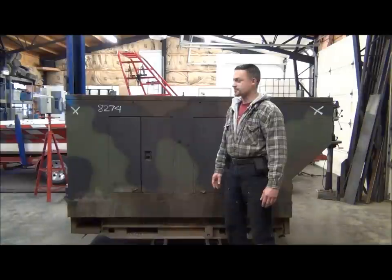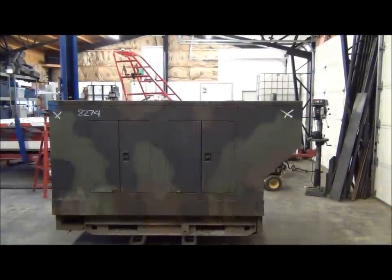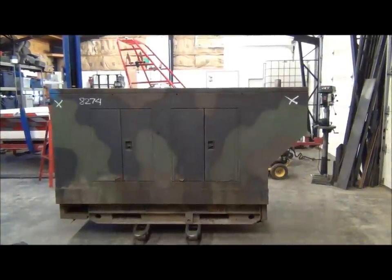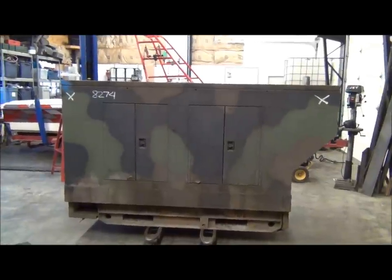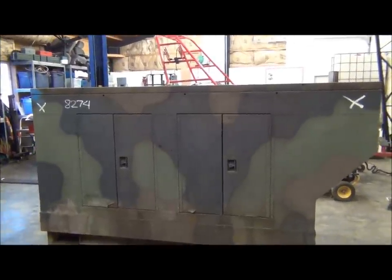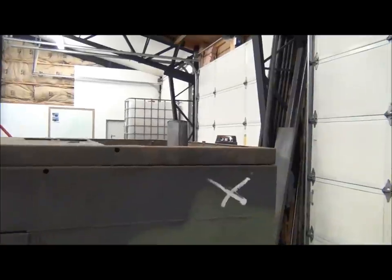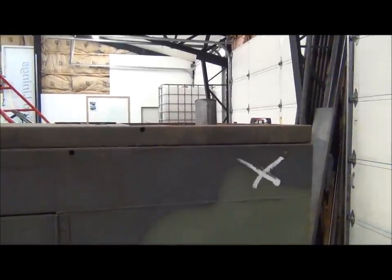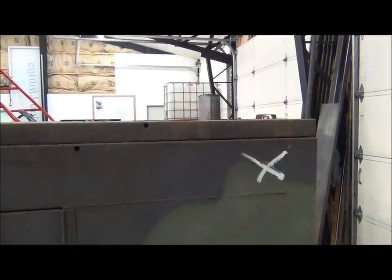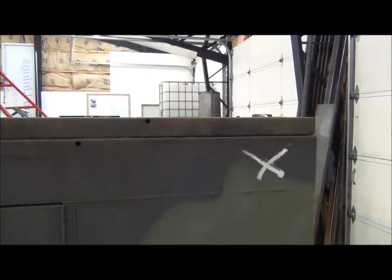It's definitely missing some parts and it's been sitting for quite some time. The first thing I notice is that it's got the acoustic enclosure on it and it's missing both the intake and the exhaust side dog houses. Those dog houses aren't necessary for operation but they do protect the generator from excessive water entering the housing. On the exhaust side in particular, the exhaust pipe faces straight up with no protection, so my big concern is whether the engine has any water in it. I'll go ahead and crank the engine over by hand to check for water inside the cylinders or leaking out the intake or exhaust, and also check the crankcase.